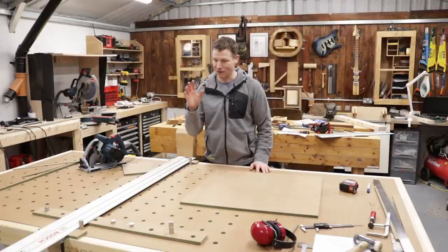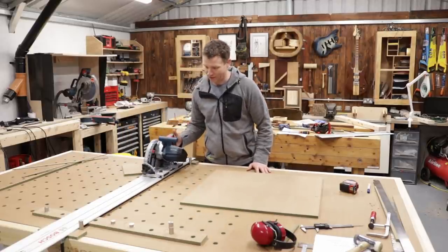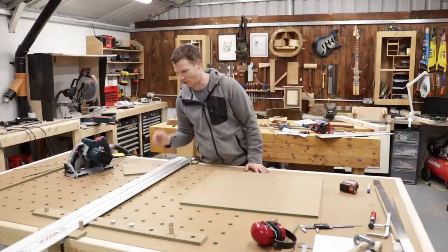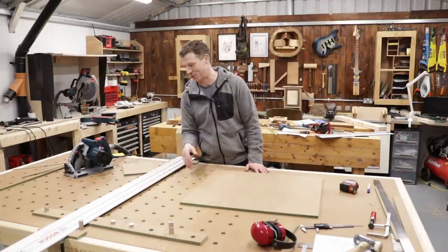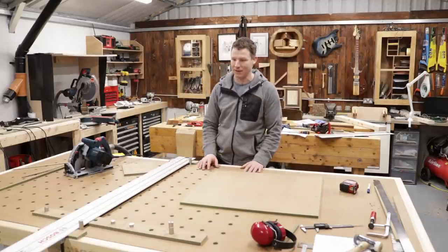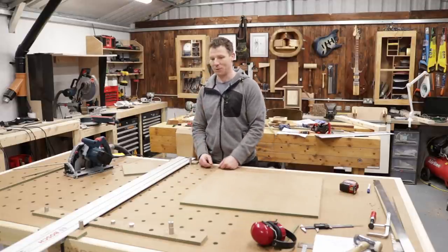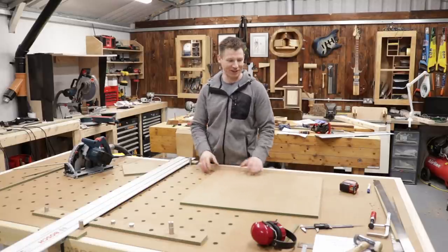Now, the dogs are really bugging me with the Bosch track system, the fact that the Bosch track saw overhangs the edge. I even hit that dog when I was trying to do the four cut test through my fence, so I had to cut a little bit deeper into my top to finish out the cut to get the blade to go through it. So cut a little deeper than I would like, but we're going to be routing in a sacrificial piece there anyway. So I'm definitely going to get the dogs with the T-slots in the top to put underneath this track. I think that's going to be a lot better, because bumping into them dogs when you're trying to be accurate is very annoying, to say the least.